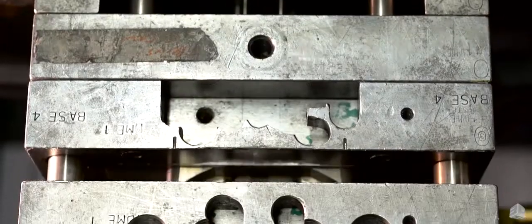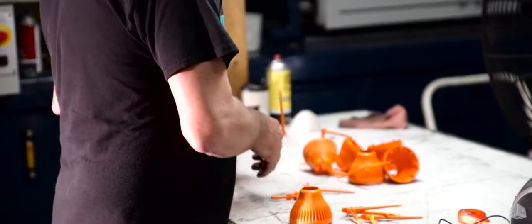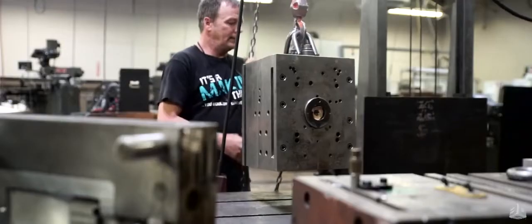When we first started working with conformal cooling, it worked very well, but it was a very manual operation, and again it required us to do the actual concepting of how that conformal cooling would be done, whereas the Cimatron adds more of an automated approach to that, so it makes it a more productive, thorough system.